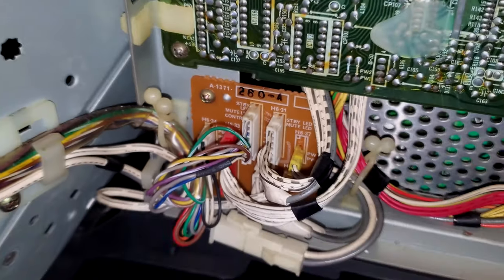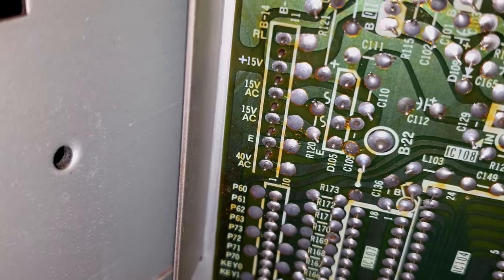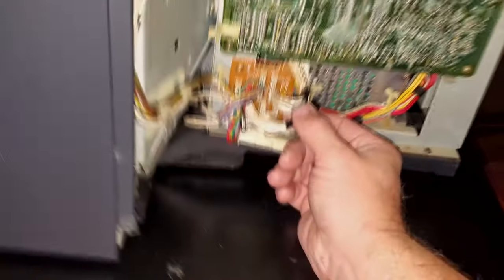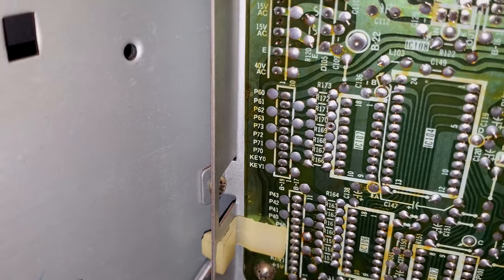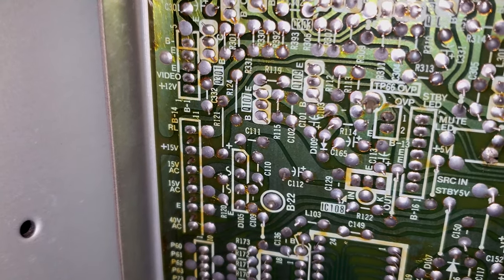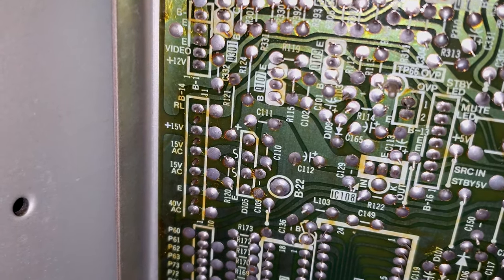That's the other side and the connection to that cable right here — if I wiggle it, it most definitely will wiggle that point. When I'm holding it down with my fingers, kind of pulling it towards me, I think it's causing those points to ground out or touch down and make continuity. And then you've got screen control. So what we're going to do is go in and get my soldering iron and reflow solder on that. Then we'll let it run for a while and see if it has any more issues, because that's definitely a point where we've got some major voltage going through the monitor.